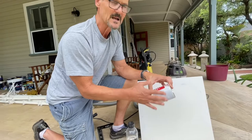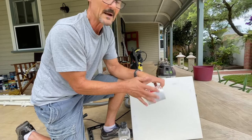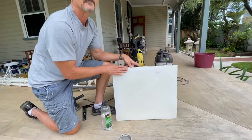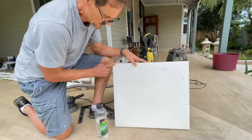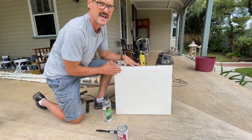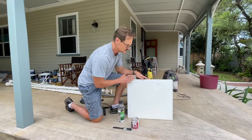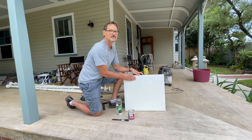Shellac is somewhat contrary to a water-based, oil-based, or even two-pack overcoat, but it's an excellent sealer primer to allow for a good finish. We keep applying coats and sand back with very fine sandpaper to get an absolutely perfect finish. In the old days, shellac was often built up into very high-gloss varnishes and very fine finishes. So shellac itself is not the finish coat — a finish coat goes over the top of it.